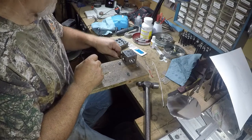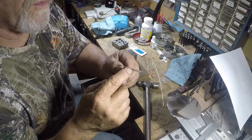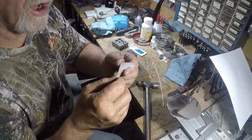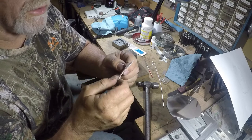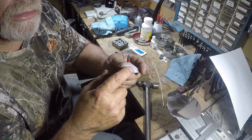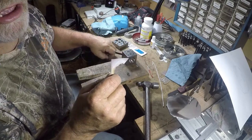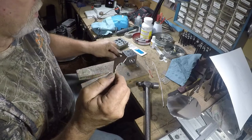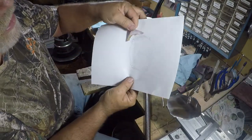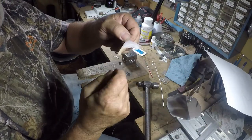I've come up with a little jig. I took some 14 gauge copper — because copper takes a lot more heat than silver, so the solder is not going to stick to the copper because I'm not going to get it hot enough. Plus these beads are only 22 gauge and this is 14 gauge. What I do is I glued this pattern — this outer pattern — onto my copper and then I sawed it out to make that little sawtooth design.